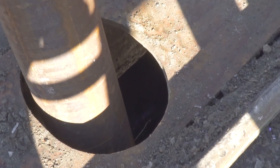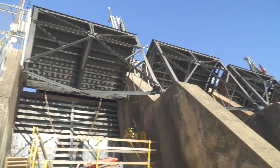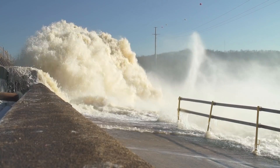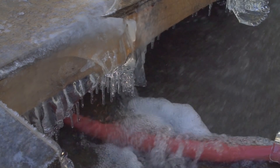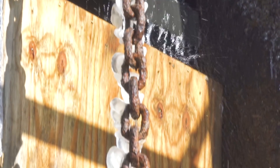We're installing a total of 984 micro-piles to basically replace all the wood and timbers, and when we're done, the design is set so there's no need for any soils, timber piles, or anything else — it can be completely supported on these micro-piles. It's about 18 degrees, so challenging today versus our normal working conditions, but we're working through it.